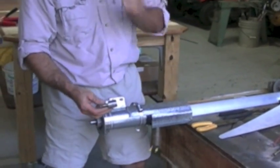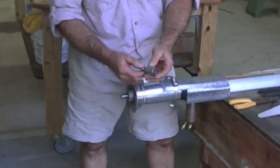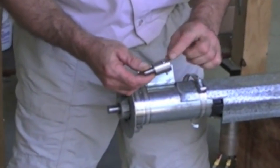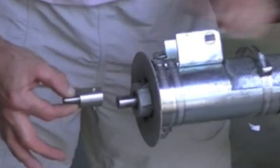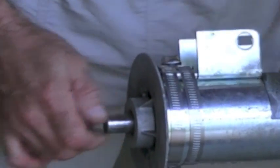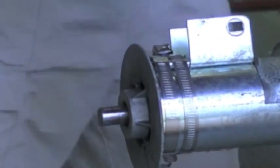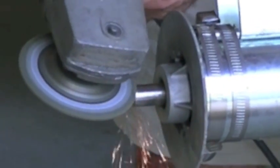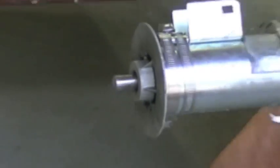This is a little hub arbor that I bought from WindyNation. It has three set screws in it and it just slips on and will clamp down to the shaft. I'm going to take and grind a little flat spot for one of them to sit on, just to ensure that it doesn't slip.